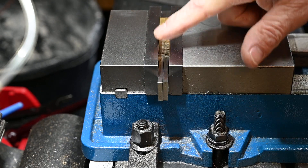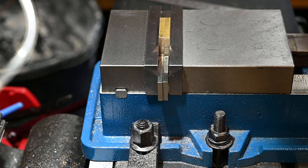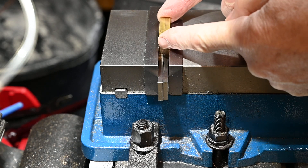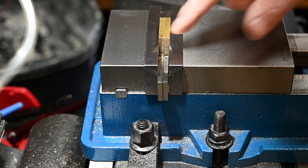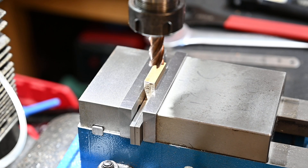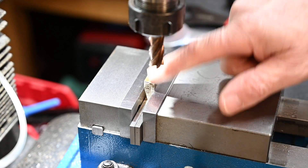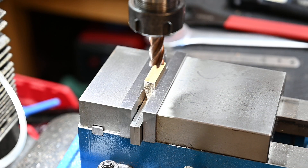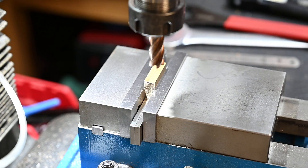I'm just going to machine these as a starting point for a couple of reference surfaces, and then I'm going to mill it down to length so I can start setting out the positions. I'm going to mill this face off, flip them over and mill the other face off, and then I can set them up, mill the ends, and get them to size.